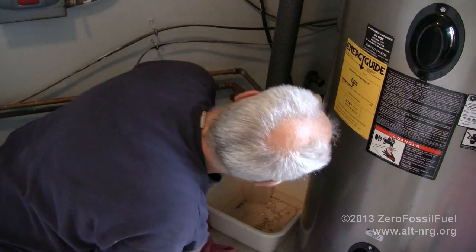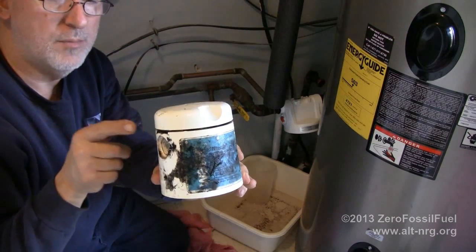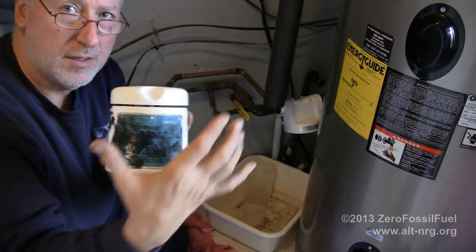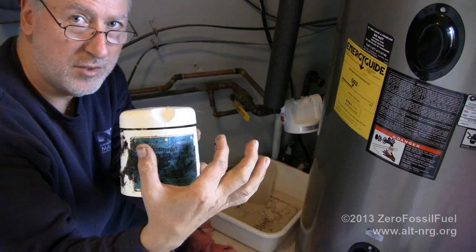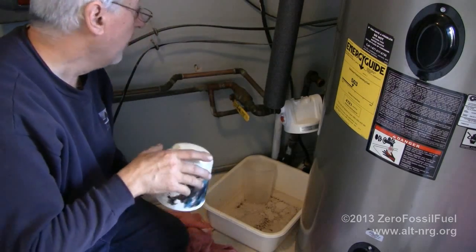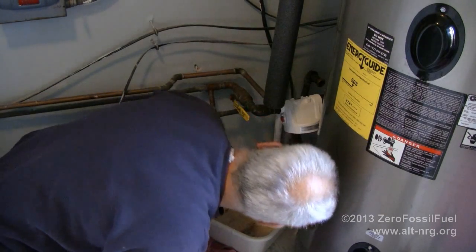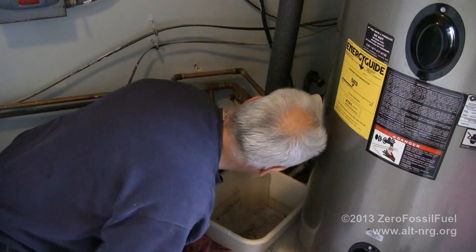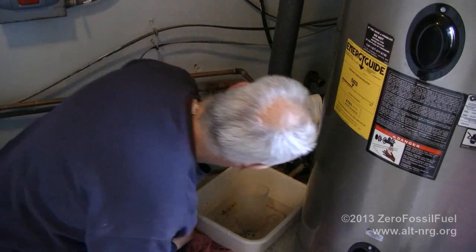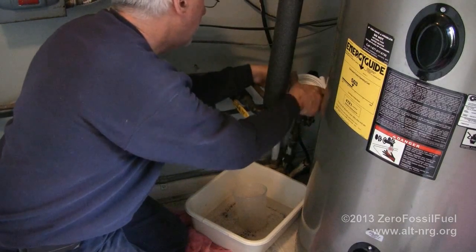Okay. Now what has become painfully obvious all of a sudden is the fact that the span between the inlet fitting and the outlet fitting on the old head for the water filter is more narrow than it is on the new water filter, which is like so in comparison. So my compression fittings on the pipe down below here are not going to line up exactly as I want them to. Fortunately, the way it was assembled gives me the opportunity to bend the pipes a little bit. And I pray that there is enough give in there to allow me to do this.